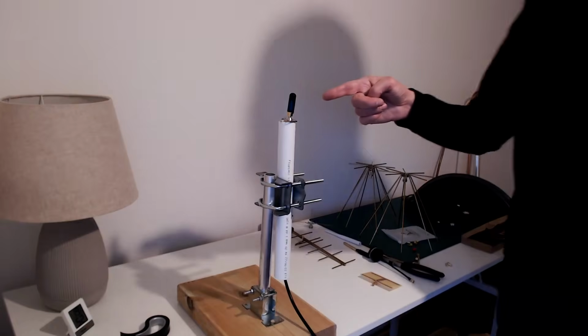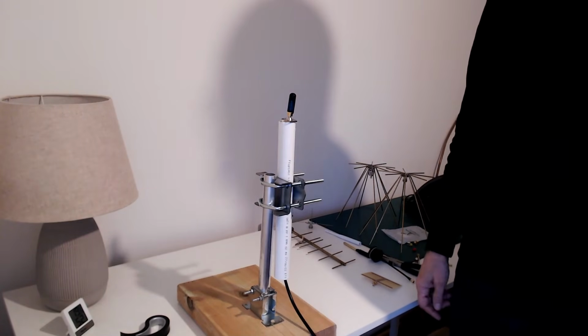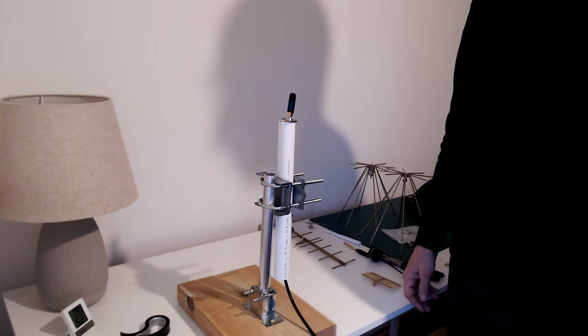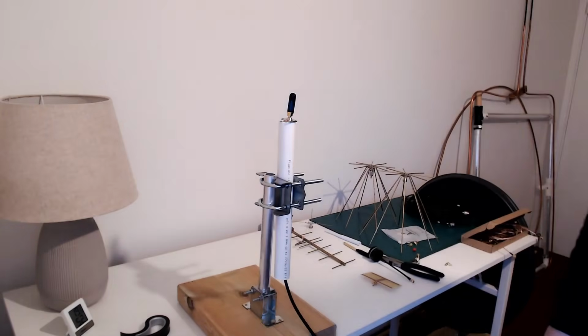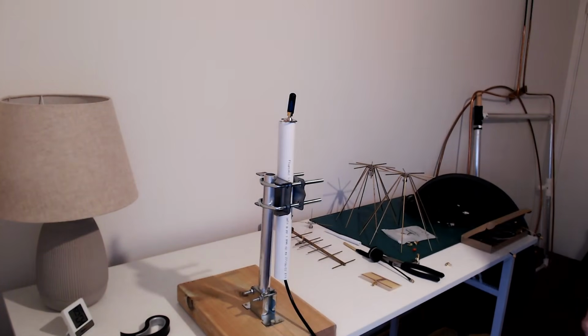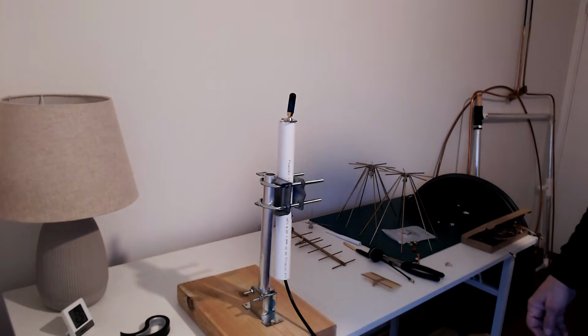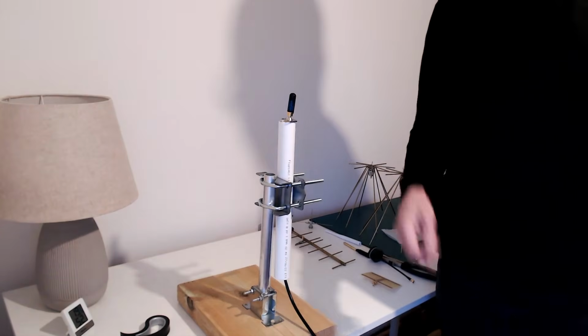Now I put on the little stub antenna with diamond written on it, and this really has gone down to only just above the noise floor of the analyzer, and I'm seeing, if I move around for the best signal, -50 dB, so 50 dB path loss, or a bit more, which is showing it's not the best antenna at this frequency.